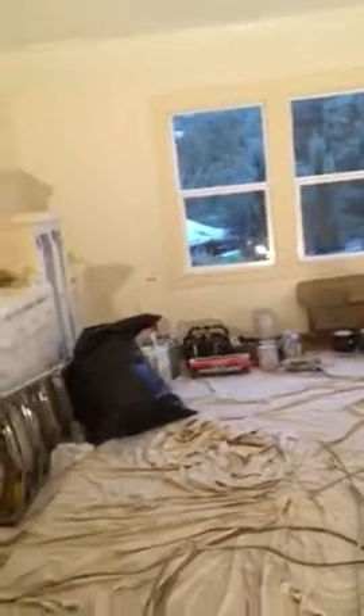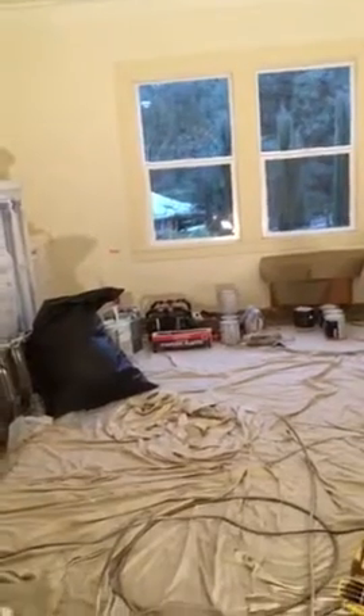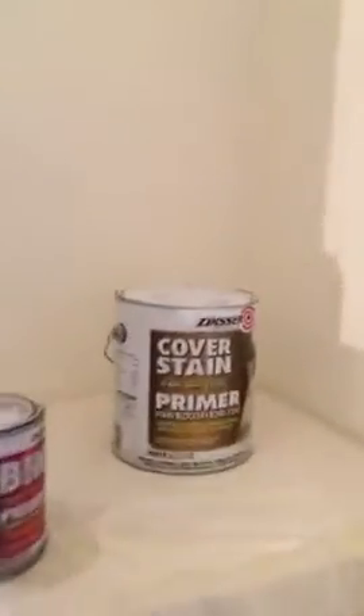It's extremely bad to have silicone next to a fireplace. But what's the old saying — if you play stupid games you win stupid prizes. They probably just threw it in there, because you can see how shiny it is and our paint's not sticking to it. So windows get primed then painted. The product we're using is the Zinsser Cover Stain — that is the face of evil.